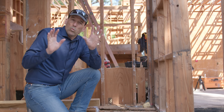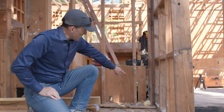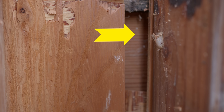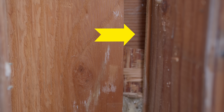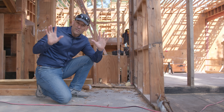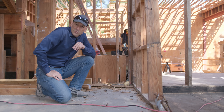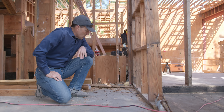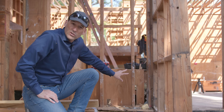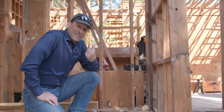When you have places that you can't see easily, you really find out what kind of quality you're talking about. In this shear wall, where we have this really important plywood layer, it's actually broken — they used just small pieces of plywood to fill in the space. Small pieces of plywood do not make up a shear wall. It has to be one big piece, or if multiple pieces, all the edges have to be blocked. Here they've cut a two-foot-long channel in that plywood, which will completely eliminate all structural integrity of the shear wall. They hid it behind the landing of the staircase. That's a definite red flag.